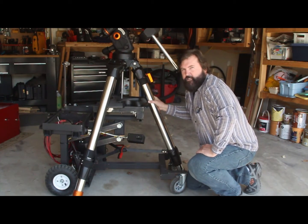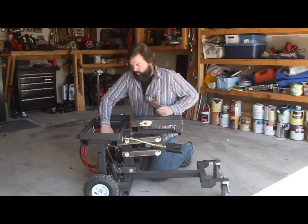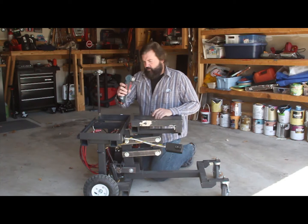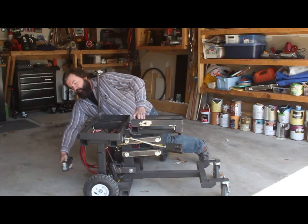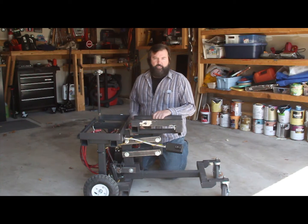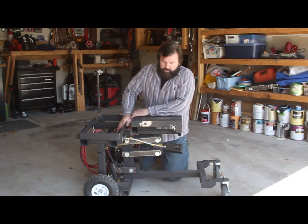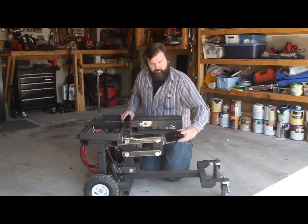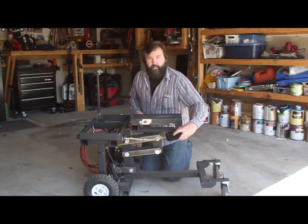And that is a tremendous improvement. When I originally designed this, there's a screw here that raises this arm up and down. I used my Bosch and put a socket on it, and I just attached it to the bottom of this screw down here. That had no problem powering it up and down, but the disadvantage was I had to go underneath each time and attach it. I've now attached an electric motor and a car battery, and there's an automotive switch right here on a flexible stock. All I have to do is press the button and it starts rising. The other way, it goes down.